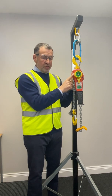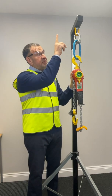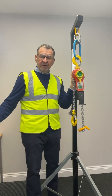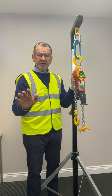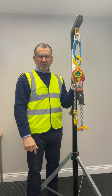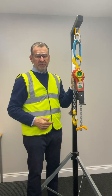This is an important key design feature. When the hoist is being operated perhaps three, six, nine metres away and the operative is pulling and paying out the load chain to rig a load, if the brake mechanism engages on all first-generation hoists, the operator has to go all the way back to the grip brake to re-engage neutral and continue rigging. This takes time, effort and adds risk to the procedure.